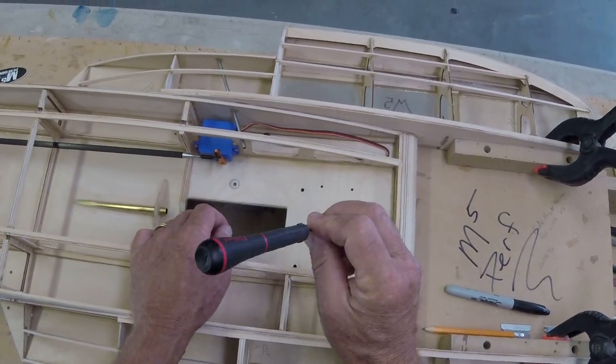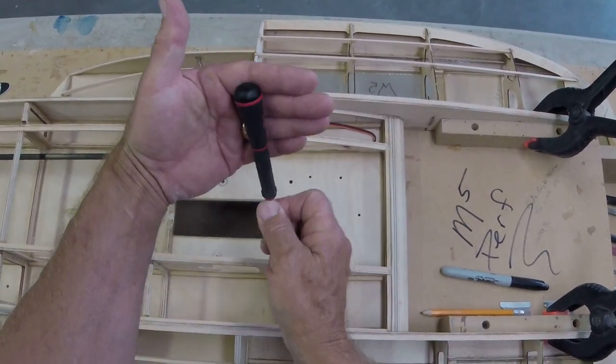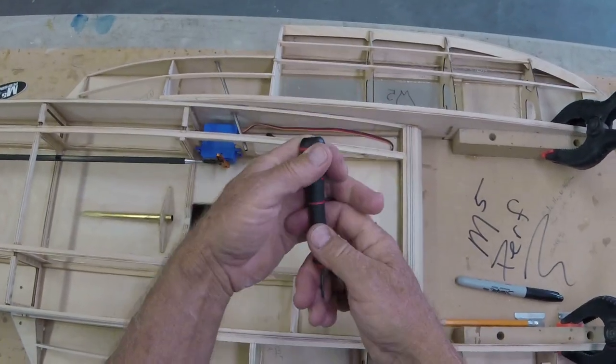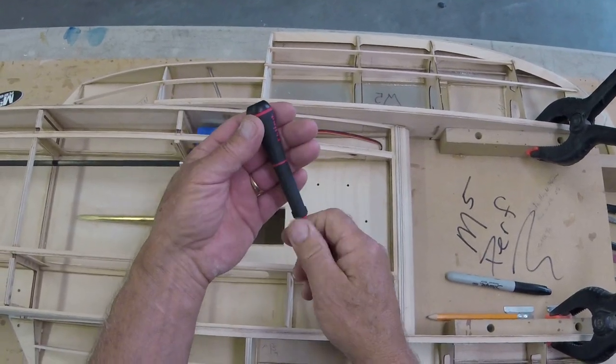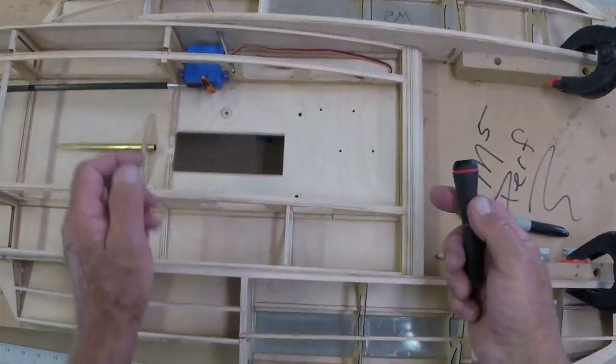There is none, unless you don't adjust your end points correctly and the throttle hits all the way at full throttle. And you're sitting there pounding the throttle and that servo is struggling against that thing and the motor's shaking, and yes, now you're beating up your gears. No, just stop a little bit short. You won't know the difference.